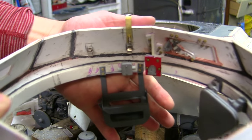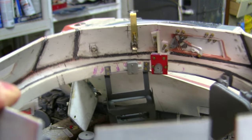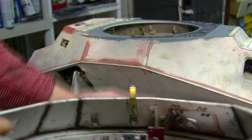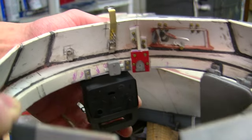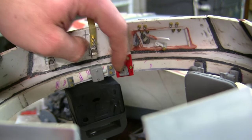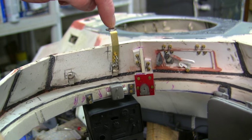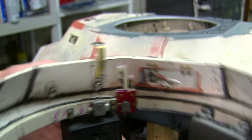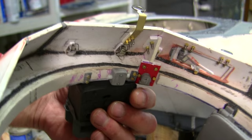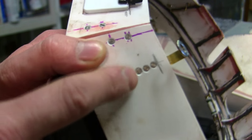Here goes the radio mount, now permanently affixed to the turret. As you can see, it descends down into the fighting compartment and the radio still fits in. Moving up from the radio, we have a transformer box. A wire will come out of the radio, into this box, then run up to the antenna aerial base, which will be mounted on this mount. The antenna base was fabricated out of brass and a soldered washer, mounted on a spacer to the turret with countersunk slot screw fasteners, just like the real unit.